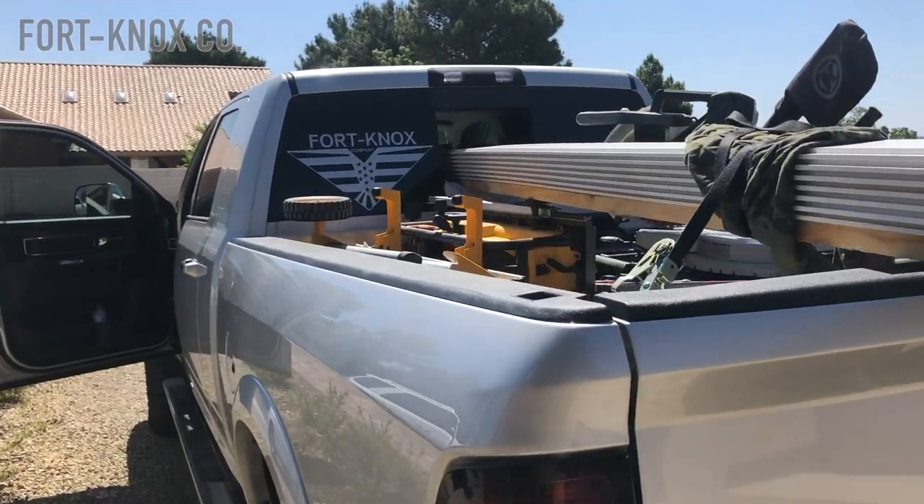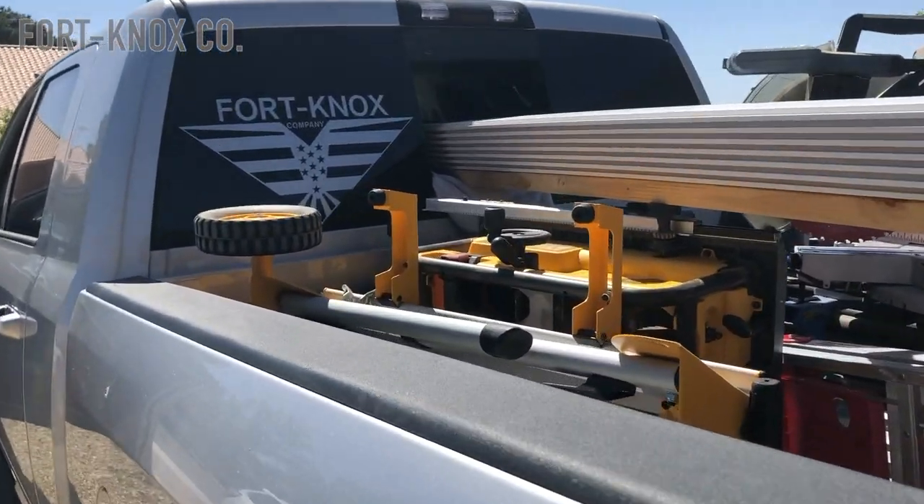This was a small project I did over the weekend — somebody wanted me to help them put some shiplap up in the bathroom. It was a fun project, not too long; it took about an afternoon. I did do a little bit of prep work ahead of time: I painted the shiplap so that I didn't have to do any major painting once it was up. If you've ever installed something and then had to paint it afterwards, you know it's a pain, so I painted the material ahead of time.